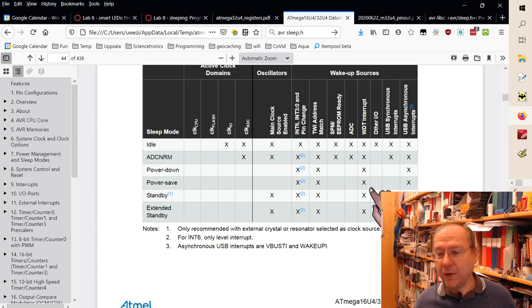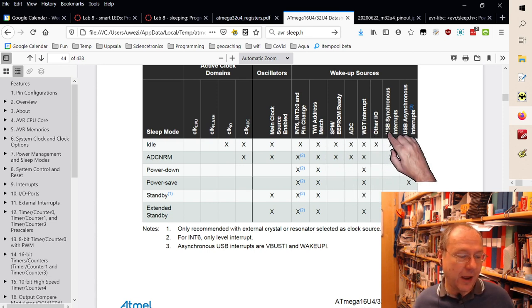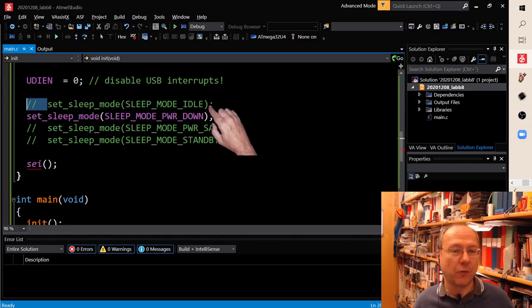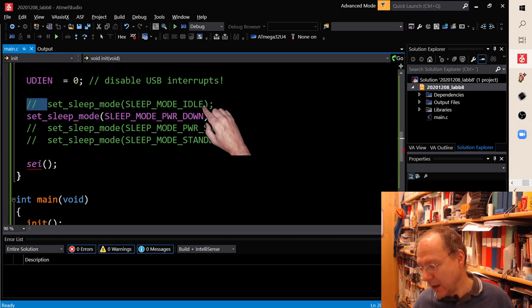But this was so to show you that a regular timer interrupt can actually wake up a CPU from an idle mode when the code execution is halted, which we can use to actually save power. How much power we can save, as I said, I have to postpone this information because I would have to prepare a USB cable, a special USB cable where I can have a multimeter in series with the power cord. The ones which I have are simply not sensitive enough.